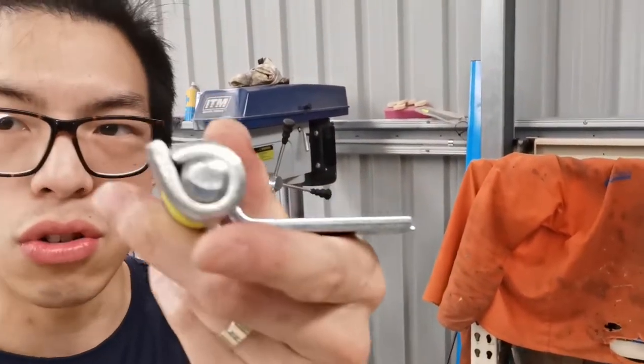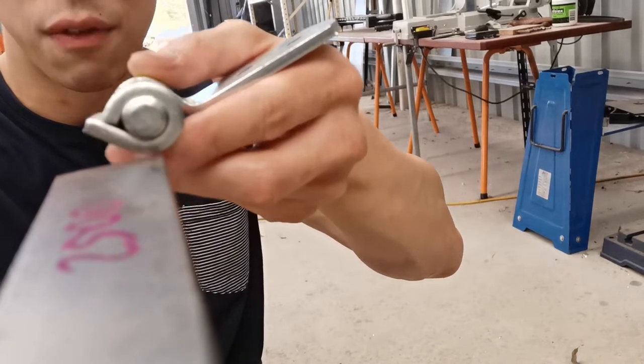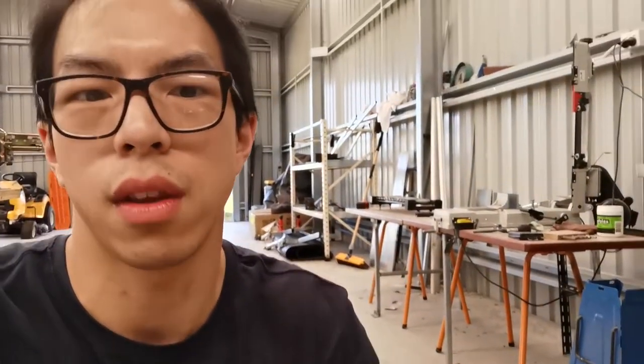And the other thing that is really important is the hinge. You will need a couple of hinges to operate the fold-up bit. But the hinge, very tricky, needs to stay somewhere in here instead of going up there. It has to stay in the axis of movement. That way, you can guarantee the fold is the sharpest, if you know what I mean. If I can show you how I build this, all of this will make sense. So now I'm just going to cut some steel. I'll prepare all the pieces that I need, and I'll get back to video recording.